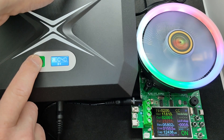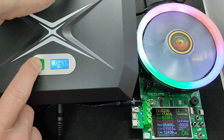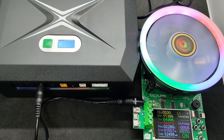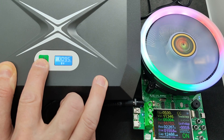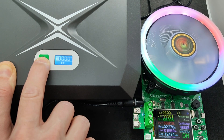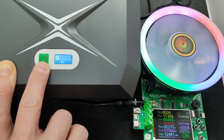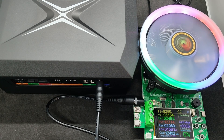Power is at 40% of maximum; no mains power connected. Testing the most powerful ports: 12 volts, 5 amps. Voltage sag of 0.6 volts. Power almost matches the actual value. Load at 95%, no external power. In reality, the declared power is slightly exaggerated. Testing at 5 volts, 2.5 amps — everything is excellent here. No sags; holds the declared power.